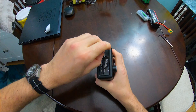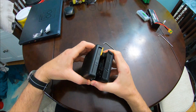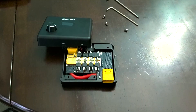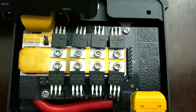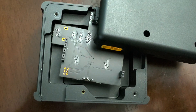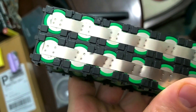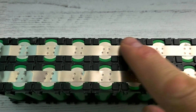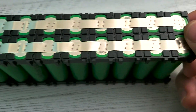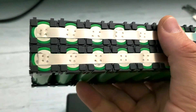There's no connector to unplug it, so be careful. I'll twist it so I can show you both sides: the MOSFETs with the PCB and the display, and the back of the display. Looking at the battery, the spot welds are really clean — no burn marks, everything looks pristine. Here is a 10S2P pack, so 20 cells. I'm really impressed with the spot welds: no burn marks, I went one after each other, and it didn't heat up.